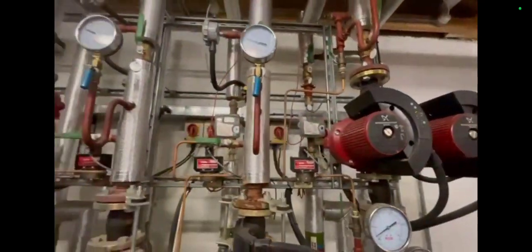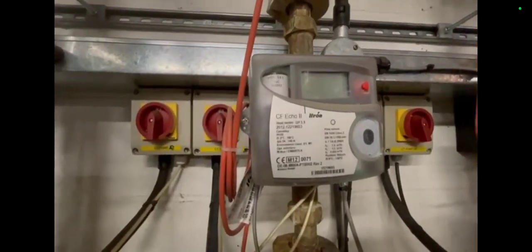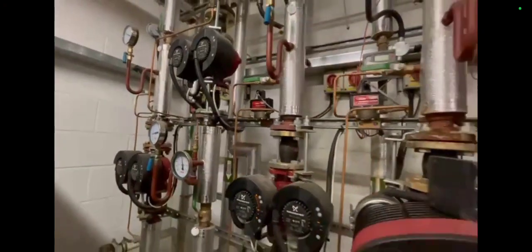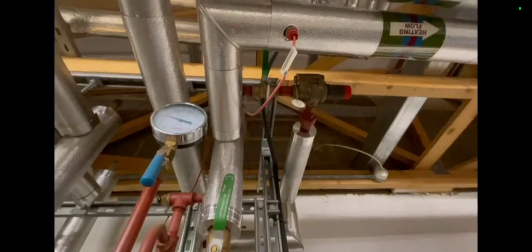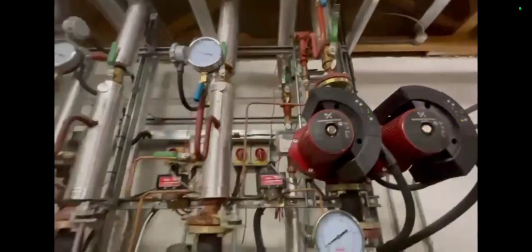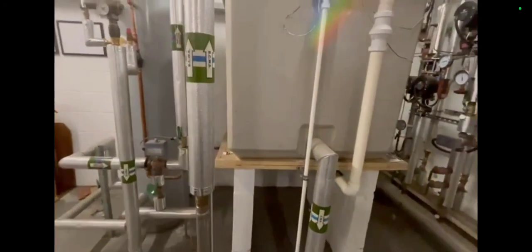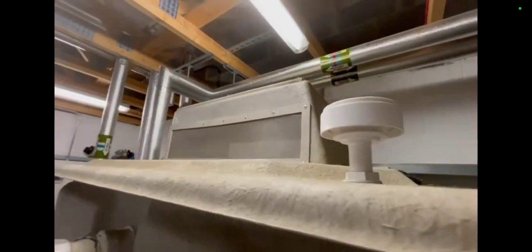On this VT circuit there's a Magna pump. I like when they put gauges either side of the pump to give you an indication that it's working — that is very helpful. Sometimes you'd wonder; at least there's a green light or something, but I guess that's why you have the BMS panel. There looks like a balancing or blending valve — or actually a bypass of the flow and return — and then more pipework up there. It's funny because sometimes the people that put the lagging on aren't always sure of the direction of the pipework — I've seen it wrong before. The directions on valves don't always take as gospel; they can be wrong, sometimes put on by an independent company doing lagging.